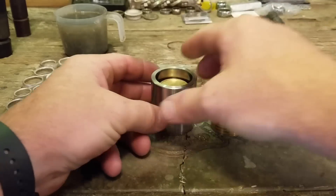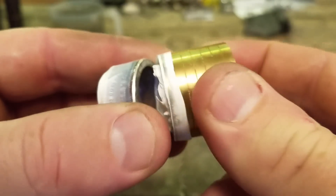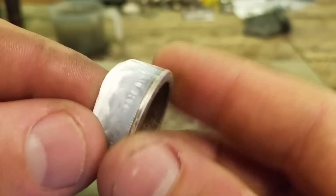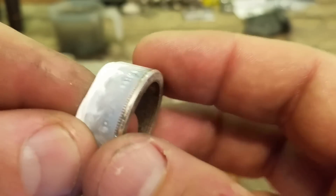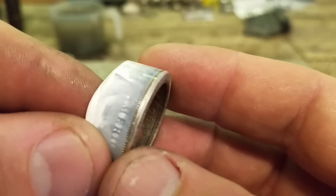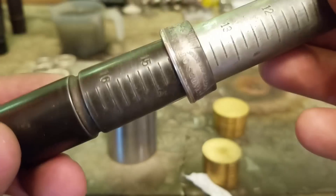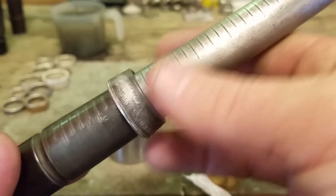Let's pull it out and see what we have. Take the first one off, take the second one off, and out comes this plug. We remove the Teflon — take a look at how it totally preserved the detail in there. If it was too thin you'll start seeing the detail coming through the Teflon, meaning you're hitting the detail in the die, and that's not good. Pull this Teflon off and we're sitting about at a 14.5, exactly like my notes had set, so we're exactly on track.